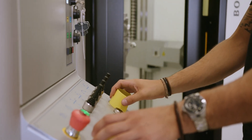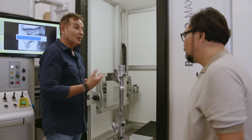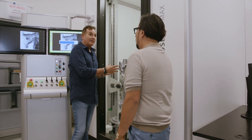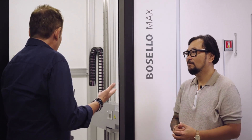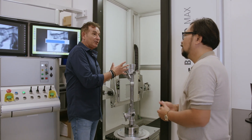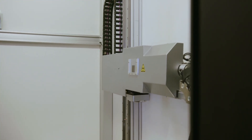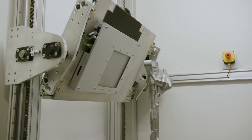Because usually when I see CT inspection it takes about 30 minutes. It's a different technology for different purposes. This is finished — you can remove the part and load the next one, or prepare a program for different kinds of parts. Cycle time is approximately less than one minute — between 30 seconds and one minute. So it's very fast, about two seconds per shot. Depending on the complexity of the part you need more or fewer shots, but it's much faster than CT.